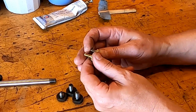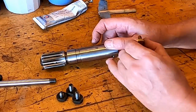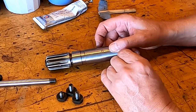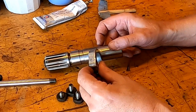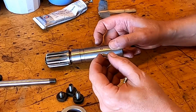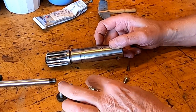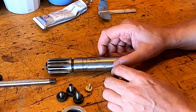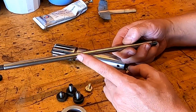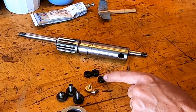And these are a couple of brass knurled knobs that I made. You can actually see the indent. It's flat now, but it was causing it to not move through the collar very well. The collar was catching up on that. So once I got that flat, I decided there's no way I'm going to put a steel screw back in there. So I made a brass one for there, and then I made another brass one for this because this also got a good indent on it.